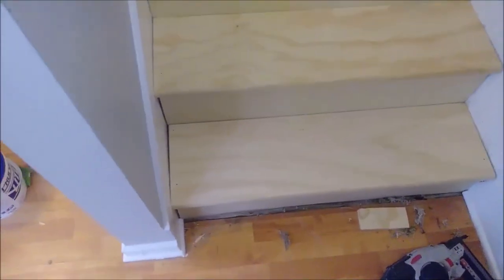I want to tell you that the overhang here is exactly one inch. You can see it's all of them exactly one inch — and why is that? Because you don't really want leverage here. You don't want to put it more than one inch, because then you'll create leverage and put pressure on the stairs. You can see the nails here, here, and here — three nails in each place. We need to use a wood filler where the nails are to cover them.